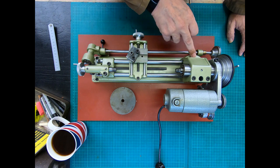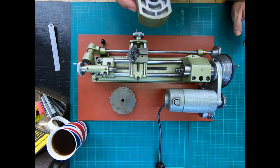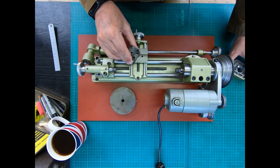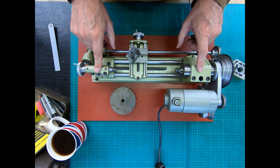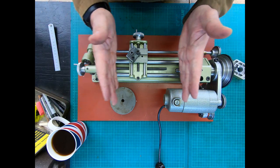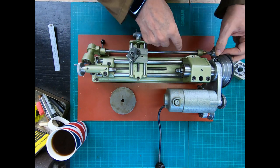I think I will investigate whether it's possible to drill a hole through and make a longer alignment pin, so that would allow the alignment if you want. I've got another accessory I'd like to show you so we'll use the riser block again soon. If there isn't a way of doing alignment with the pin, there's another way - I haven't got the thing yet but we'll make one in the near future, which effectively fits into the spindle and into the tailstock, so you push these two together and that creates the alignment. Then you do up the cap head bolt at the back to lock it in place.